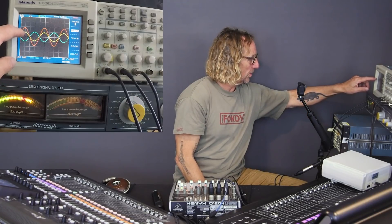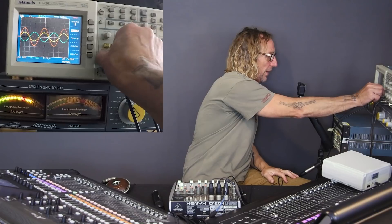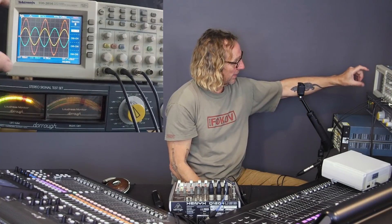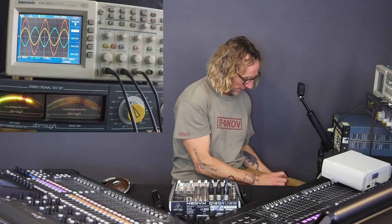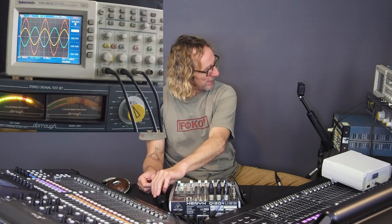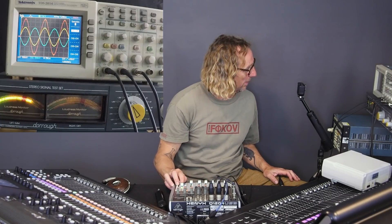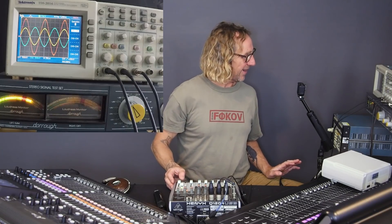At one volt in, we step up to 2.5 then about 3.5 volts, and we can see it on the scope — seven squares out of eight, with about half a square down on top and bottom: that's our 3.5 volts on the red trace on the M32. The X32 is exactly the same with a very slight difference. On the Behringer I had to bring it down to match. Now they're all calibrated and we're seeing what I saw originally. I'd have never found this using standard test gear — I would have assumed similar outputs, which they don't have. The 'oh sh*t' moment turned into an 'aha' moment.